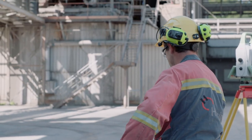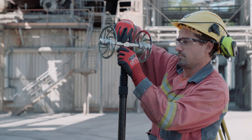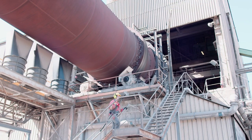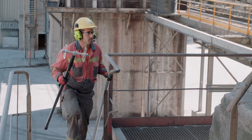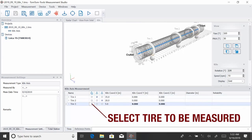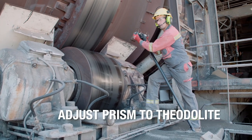For the tire measurement, the telescopic pole and the target axle are needed. Mount the axle onto the pole and make sure that it is securely tightened. The assistant goes up to the pier and holds the target axle onto the tire. The PC user navigates to the tire table and selects the tire which will be measured first — here, number three. The prism in use needs to be adjusted to ensure it is orientated towards the theodolite.